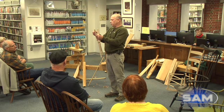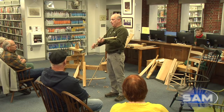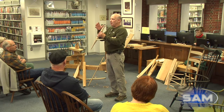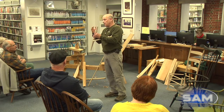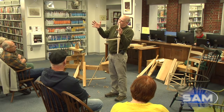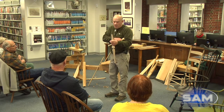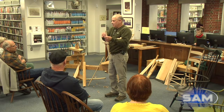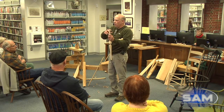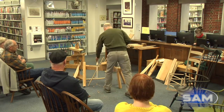I have a bunch of holes on top of the box, and the leg sits in the hole so about this much of the leg is inside the kiln for three or four days. After that, the tenon portion is dry — bone dry, as dry as I can get it. I cover the rest of the leg with tin foil because I only want the tenon to dry out. Once it's dry, I put it back on the lathe and true the tenon to a six-degree taper. Wood that's turned round doesn't stay round as it dries — it becomes oval because it dries more in the tangential plane than the radial plane. That's why the tenon is turned oversized; I true it back up to get it perfectly round again.